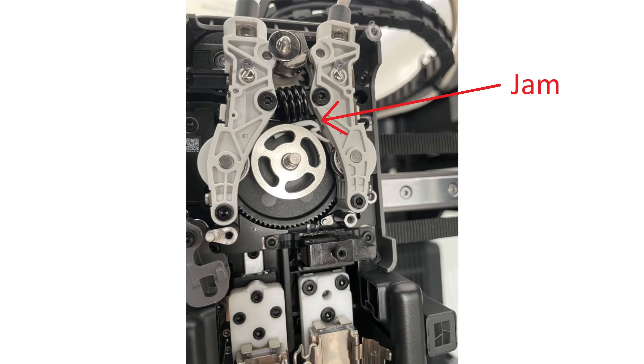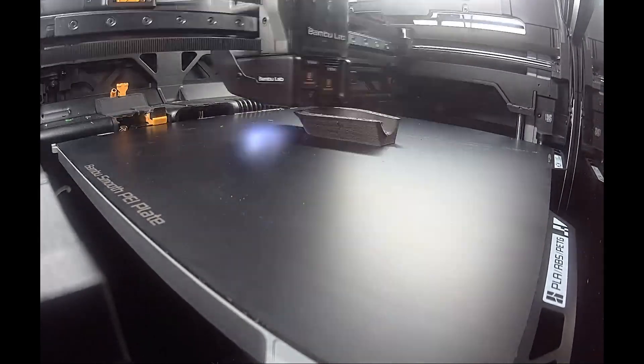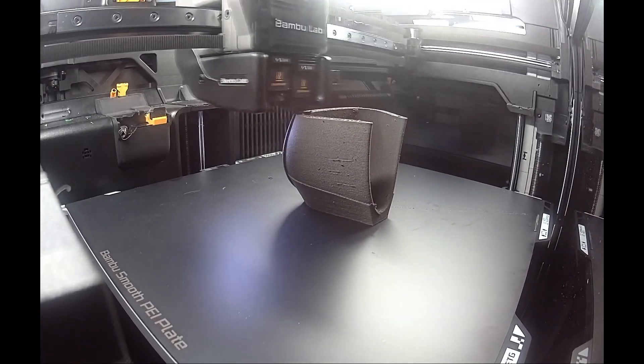The source of this issue seems to be the opening of the filament path as the singular drive gear is disengaged from one filament and engaged with the other. This was a clever tactic Bambu used to lower the weight of the dual nozzle printhead, but evidently it isn't without its flaws. This would be one example where the Prusa XL, with its multiple dedicated tool heads, might be superior. But perhaps Bambu Lab will find a fix for this. And even if they don't, it's not a deal breaker, as I've found ways to get around the need for support material for this particular filament. So for foaming TPU, I stick to single nozzle printing, which works out great — same as it did for me on the X1C.